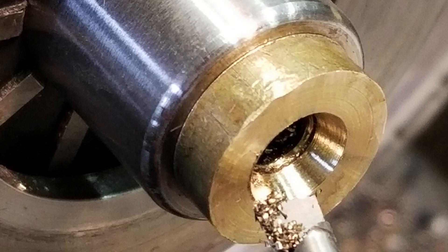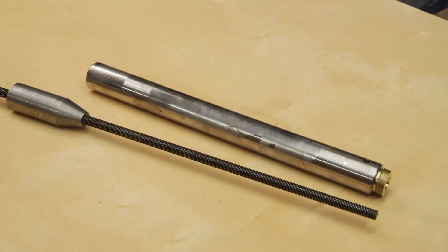What I did was lightly press a piece of brass into one end of the quill — the handwheel end — and then with the quill held in a collet chuck, turned a center into the piece of brass. This should get my center very close to the current OD of the quill. I then made a steel piece with a taper to match the collet seat on the other end of the quill and put a threaded rod through so I could sandwich the quill between the pressed-in brass piece and the collet-mimicking tapered piece.